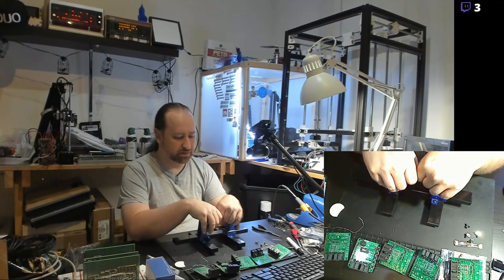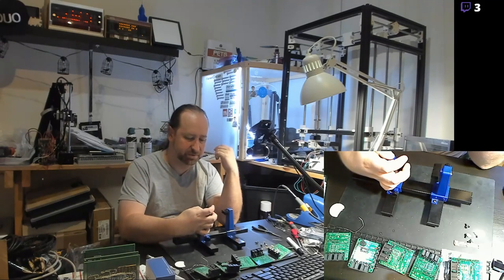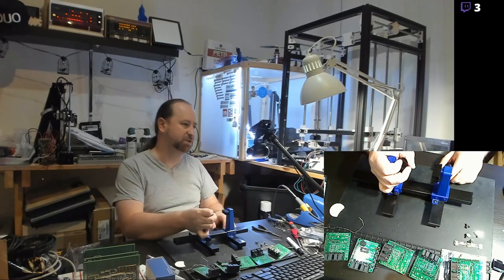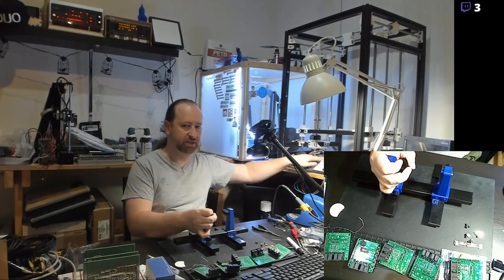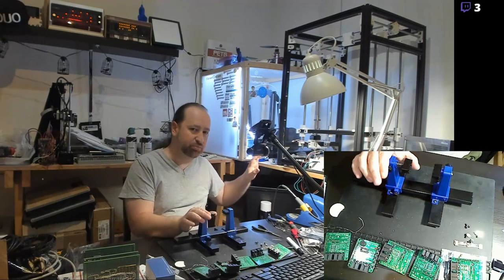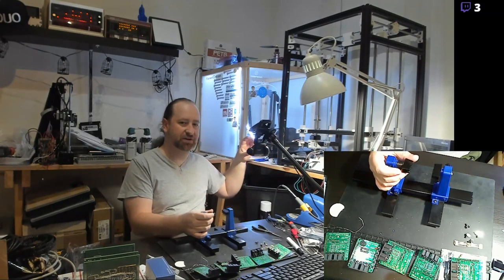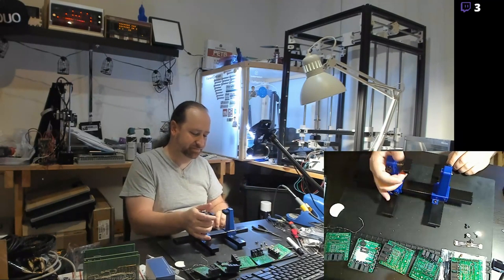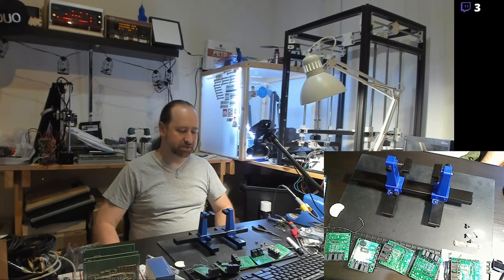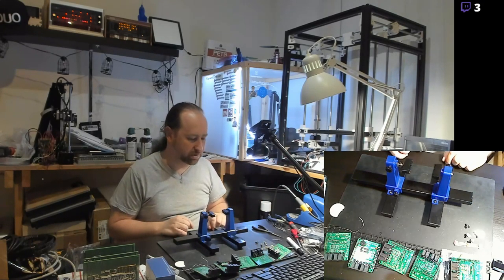And I've been hearing that quite a few people are investigating Marlin 2 and all the little things that need to be done to get it running on the Duet 2. Technically you can put Marlin 2 on a Duet 2 right now. It's just that once you get it there, a lot of stuff doesn't work. A lot of little things on the board just need updated libraries, updated drivers, stuff to communicate with the rest of the hardware on the board.